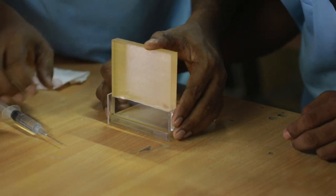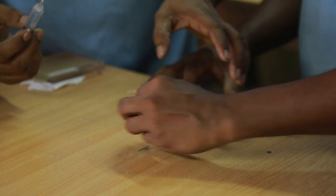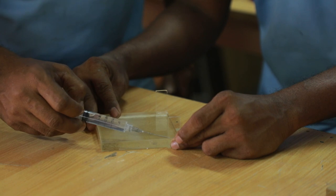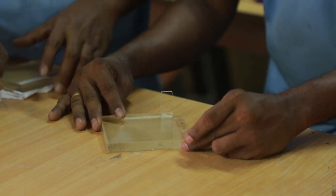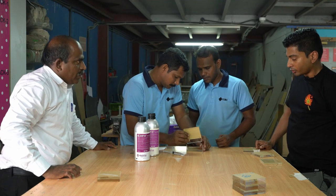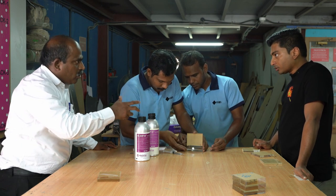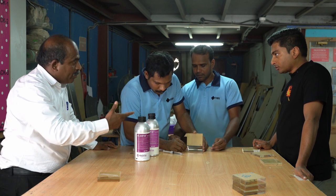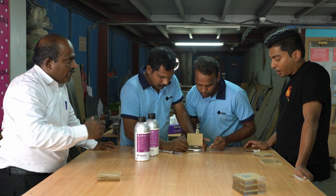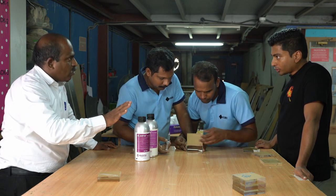The bottom piece should extend about 5 mm outside for final hand routing and polishing. The normal chloroform here is used for that initial jig bonding. The main advantage of 192 is definitely the clarity of the bond and, most importantly, the strength of the bond — it is like concrete. At any cost, the joint will not break. The acrylic itself can break, but the joint where we apply the Acryfix will be like concrete. It becomes almost a single unified piece, and you cannot separate the two pieces after bonding.